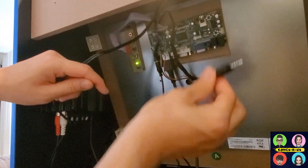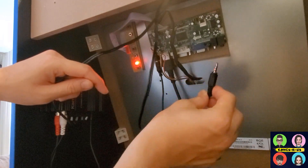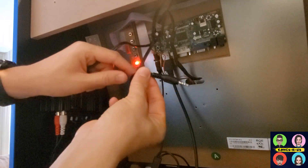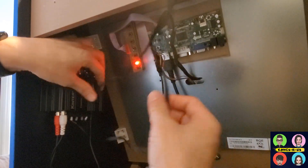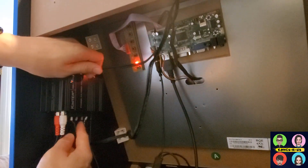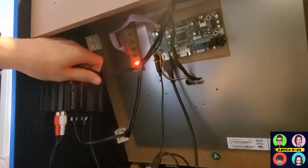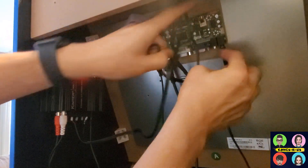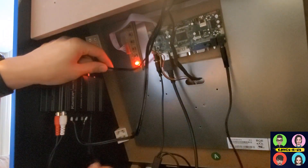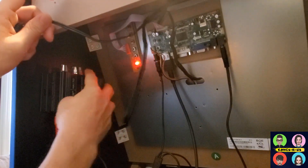On your stock cab, you'll have a cable coming out — this is the stock audio cable from your speakers that you would normally plug into your PCB. This is the cable we just cut and spliced. Here's a completed version already spliced and going into the amp. You're going to take the RCA audio cable and plug it into your LCD converter on the far right terminal.